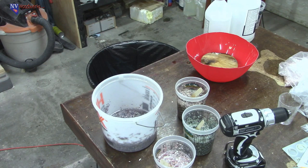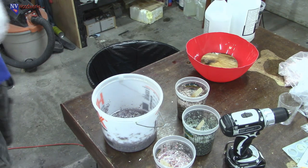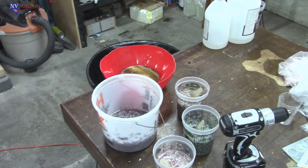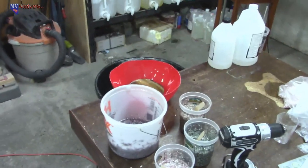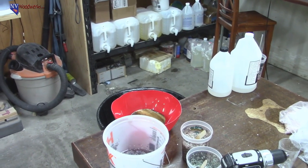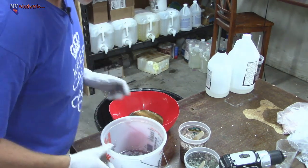Yeah, so I guess you could do something by hand with the honeycomb, but polyester resin, I hate that stuff. There's not too much good about it. The one good thing about polyester resin is it's pretty easy to polish. Because it's that brittle type, it's kind of similar to the difference between lacquer and spar varnish. Spar varnish is more like taffy, where lacquer is more like hard candy. That brittle hardness, the way that works, it just is a little bit easier to polish to get the scratch marks out. I'm gonna get this set so that you guys have a good view of what's going on. It may not be super close up, but I'd rather be a little bit further out and you guys see what's going on.